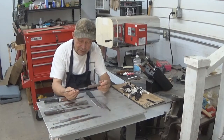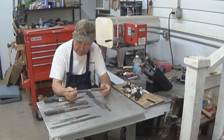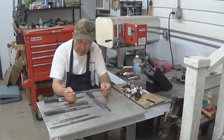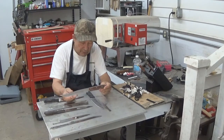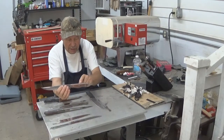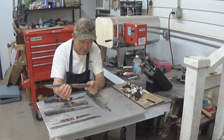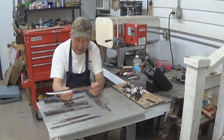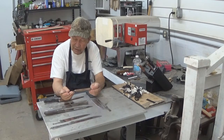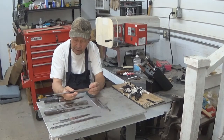Maxim Steel, it says. This is a stiff, heavy knife. Made in Japan — Seki City most likely. Rosewood grips, rosewood scales. It has this ridge here on the top, which was fashionable to put on knives back in the 1950s, supposedly to give a better grip. Actually what it did was irritate the hand, so we're going to grind this off and generally just refurbish this knife so it's a handsome, much more usable knife — not going to do too much to it compared to some of the others.